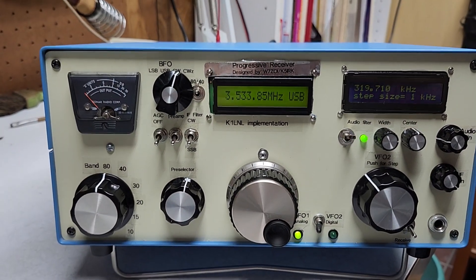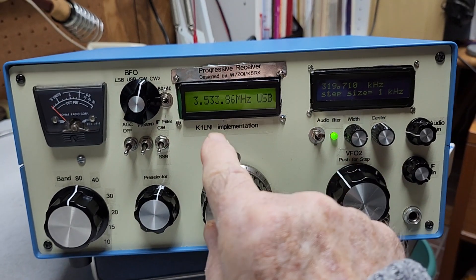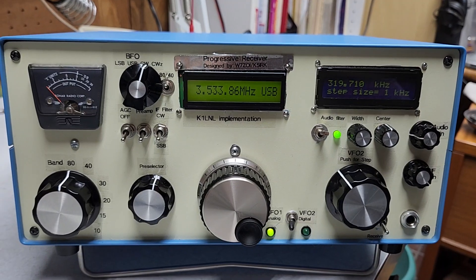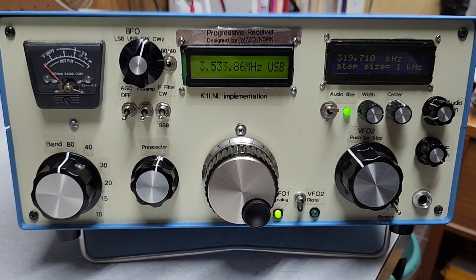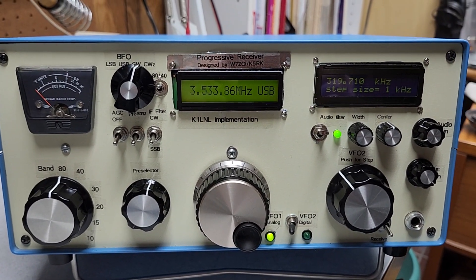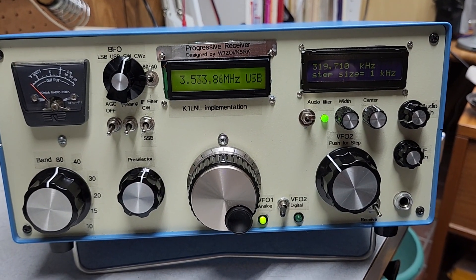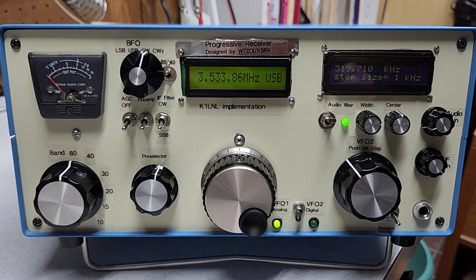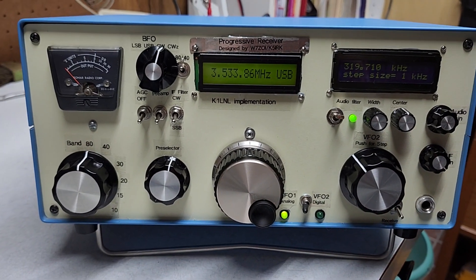I can adjust the BFO for pitch, and the CW-Z position changes it to zero beat when I've got a CW signal tuned in, giving me the correct reading on the digital display. The digital display in the center is a DFD2 frequency counter from Neil Hecht — his company was Almost All Digital Electronics; he's SK now. The display on the right is for the digital VFO from WA1FFL in Tiverton, Rhode Island. It doesn't display the actual frequency, but shows where it is in the 500 kilohertz tuning range and what step size is currently selected. That's it — I'll show you more in the next video.